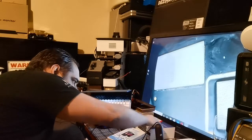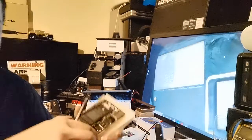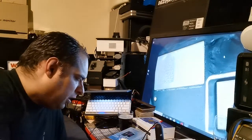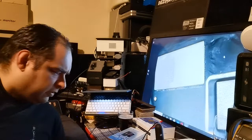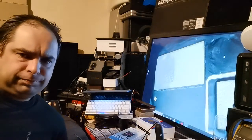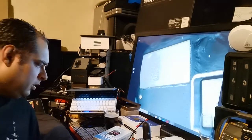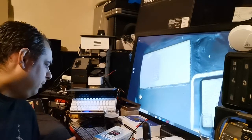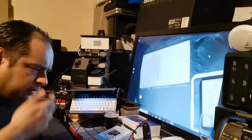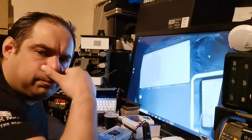That is because the logic boards inside those phones are double stacked, meaning they're soldered together. Meaning essentially this: you have a bottom board and they solder on a top board. And that's basically how the situation is. So, what we've had to do is fire up our old microscope before we go much further, because I wanted to see just how deep the damage goes before we actually do anything about it.